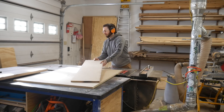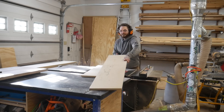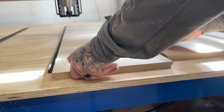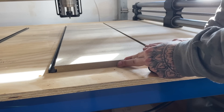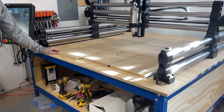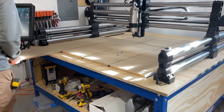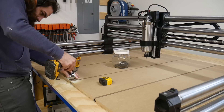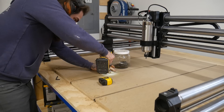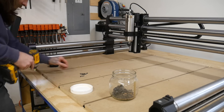Then to just rip down my half sheet of MDF — since it's a 4x4 machine it's an easy half sheet — cut it into the proper lengths and we're good to go. I'm not going to go into super detail here since I've got like three videos on how I do my wasteboards, so swing by our channel and check those out. Then I went around and marked out all the screw locations to ensure all the screw holes are even, and used this countersink bit to pre-drill all the holes and ensure the screw head sits low enough to where I won't clip it when I surface my machine.